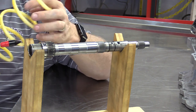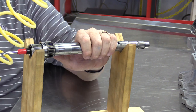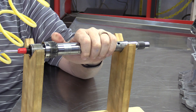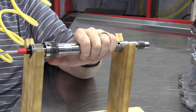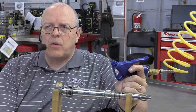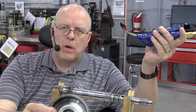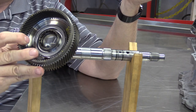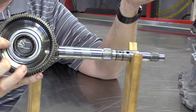I'm going to manually slide the dog clutch sleeve back to the released position, then take some compressed air into the hole in the back of the input shaft. That moves it forward — compressed air or hydraulic fluid pushes it forward. When pushed forward, it engages into an annulus gear — ZF calls it an annulus gear — engaging with teeth down inside of there.